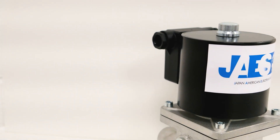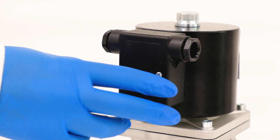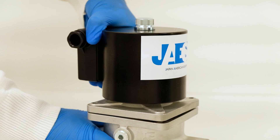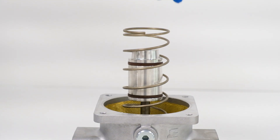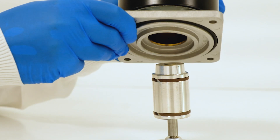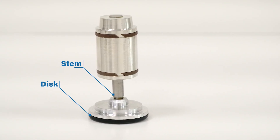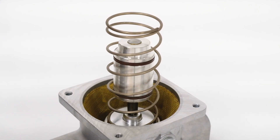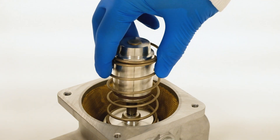In the upper part lies the casing, which closes the solenoid hermetically. It is equipped with electrical connectors and a printed circuit board for electric current management. If the solenoid is separated from the valve body, we can see the plunger. It is equipped with two gaskets to make it slide over the armature. The stem and disk are connected to it. The pressure of the fluid in the inlet chamber and a spring keep the disk pressed on its seat, closing the passage of the fluid.